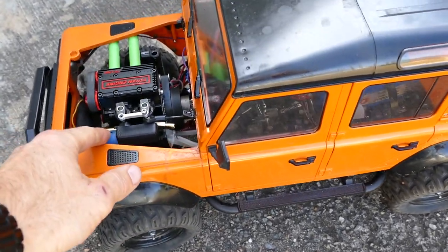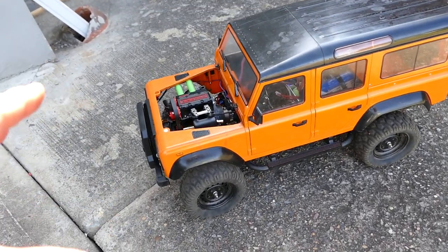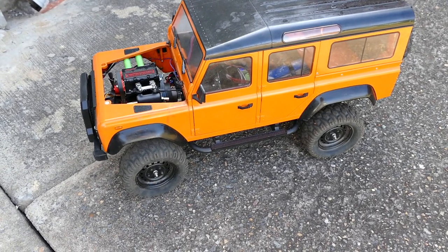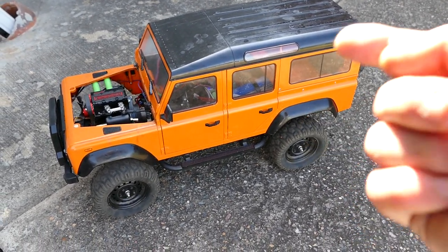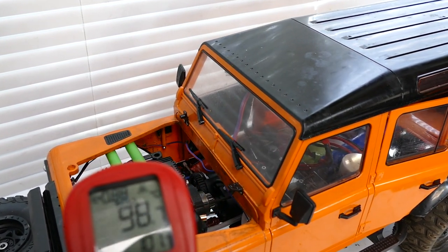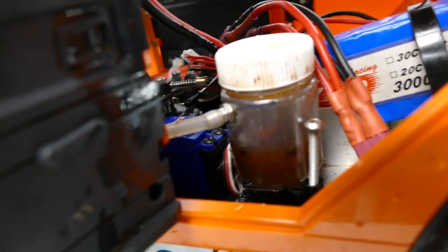I said it was going to be a short video but it turned out a little bit longer than expected. I'm going to button up a few things — see if I can get those other tyres on, fix the hood — and then take it on the trails for a proper crawl. It seems to be running fairly well. If you had questions and I missed any, please leave them in the comments. Please hit that like button, share this video, subscribe, and check out the links if you're interested. And one more thing for those interested: current head temp is 100 degrees Celsius, near the block at the bottom of the crankcase it's reading 72 degrees — and you can see how much oil the catch can collected. Pretty cool. Cheers guys!